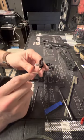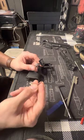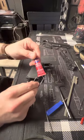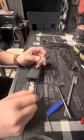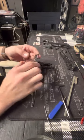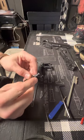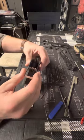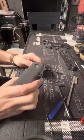I mean, if you try to unscrew that right now, you'll bend the Allen key. It'll just bend it. With red Loctite, to get it loose, you need heat. And still, that doesn't make it super easy, but that's the point. I want it permanent. I don't want it loose. So, basically, you just adjust those tabs. I mean, it comes just like this. It's ready to go. Put that on there. Throw it in. And then let's reverse the process.